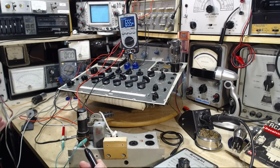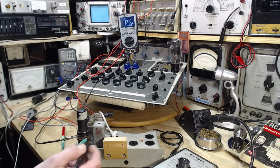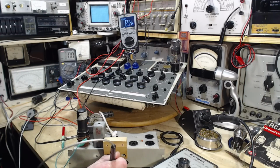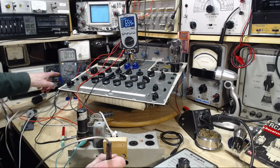Now, according to two different current meters, there's no plate current flowing. No plate current flowing because maybe the tube's in cutoff because I've got the grid bias so high. That doesn't make sense. It's more likely I'm just not using this meter properly again. So I have it in the AC, DC, milliamp, amps. This says amps. Where's the milliamps? AC milliamps. What's going on with this meter?